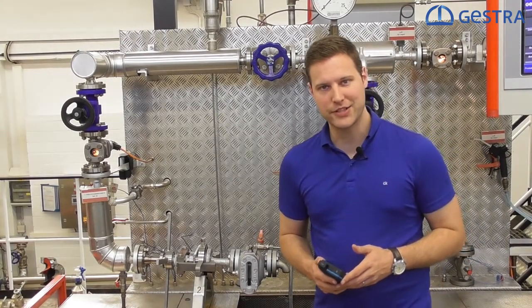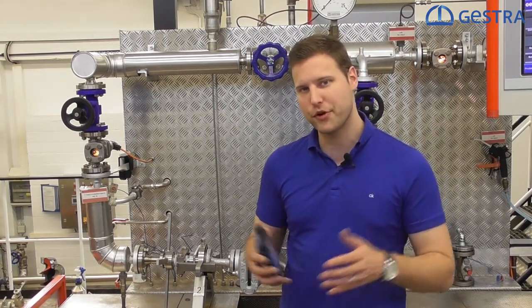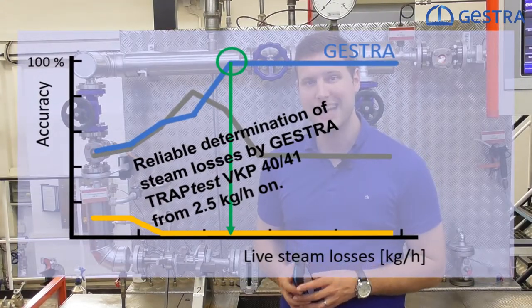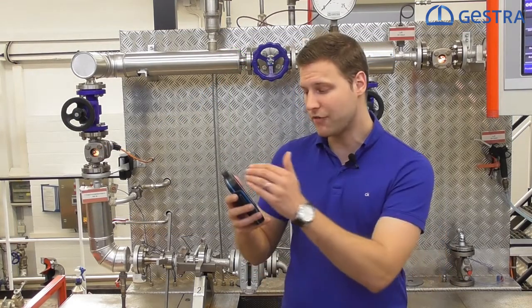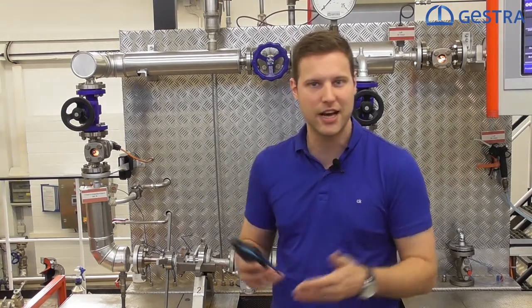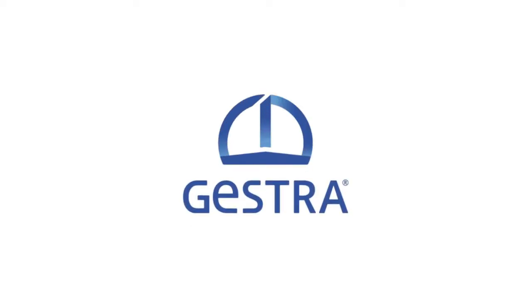The VKP41+ is the perfect steam trap measuring device because it is able to measure all different kinds of steam traps in the market — whether it is a thermodynamic, a thermostatic, a ball float, or an inverted bucket steam trap. It is a system with the highest reliability, tested and proven by an independent third party company. One of the biggest advantages is that we can save all the results, and after one year we can repeat the test to check in which sections of the plant we have damaged steam traps and in which sections everything is fine. So we can create metadata to check the availability and efficiency over the whole plant. Thank you for listening and see you next time on CheckoutGestra.